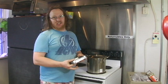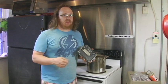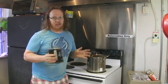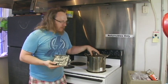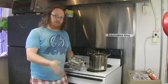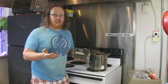Here we are in the fantastic Makerspace kitchen. The real reason I want to do it here is because we're going to be boiling this module. Some epoxies will soften up when they get to a certain temperature, at which point it gets a lot easier to start removing the resin to get to the electronics underneath. There's another good video regarding how to do this on YouTube — check down in the description for a link. The other reason I need to be specifically here at the Makerspace is that we have a fan and a fume hood directly above to capture all that steam. When you do something like this, I recommend you have disposable cookware. This stock pot only cost me $4 at the local second-hand store. We're going to add water, put the computer in, bring it up to a boil, and leave it there for a bit so everything warms up uniformly. Then I'll pull it out and see if we can chip a little bit away with the screwdriver to test whether the hot water technique is going to help us get this resin off.